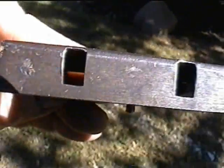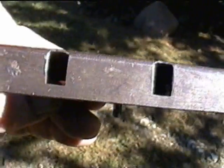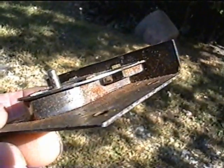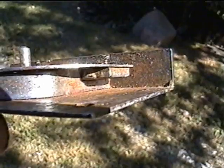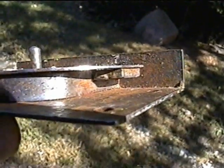This is the inside of the lock, and the ward, I'll show you in a minute how they slide. To find out basically how this works, the spring is on the top side, because what I did, I pushed up on this slide right here, and it takes quite a bit of tension to get up over that V where it'll slide in.